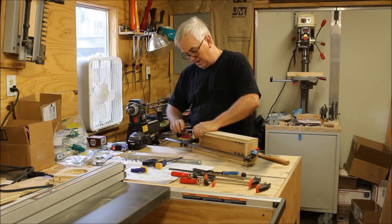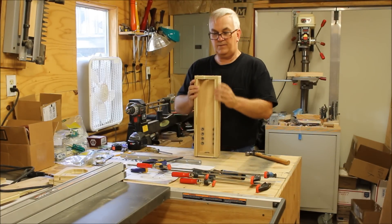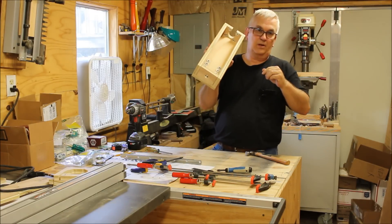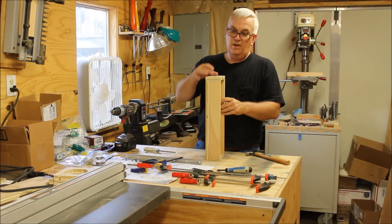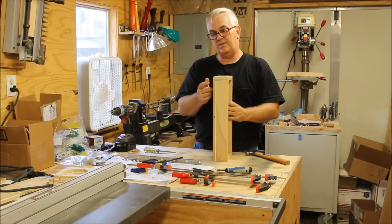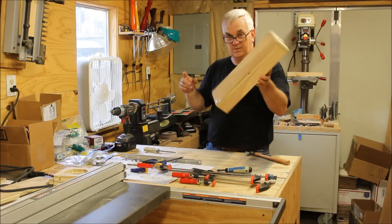Finishing up — the top is all put on. Use clamps to help keep it flush and put the parts on a flat surface. There's our box. Remember those T-nuts need to be recessed in there to work. Also, when fastening your motor, screws can be a little longer on the back two, but on the front two the screw will actually hit the inside of the front piece. Make sure your screw length accounts for any spacer block, the thickness of the stepper motor flange, and about five-eighths of thread engagement in the T-nut.